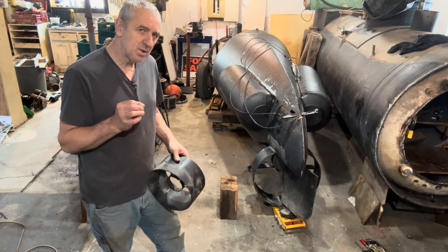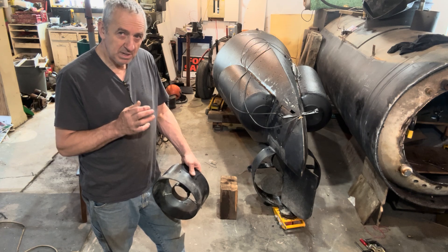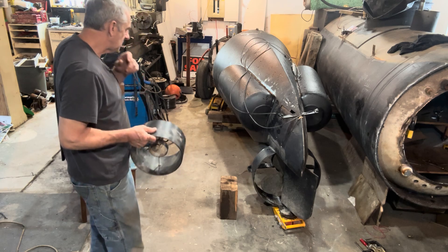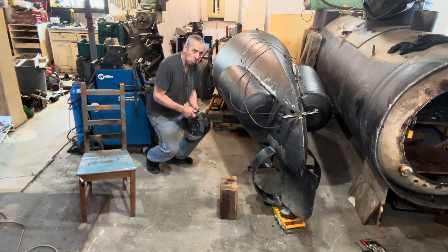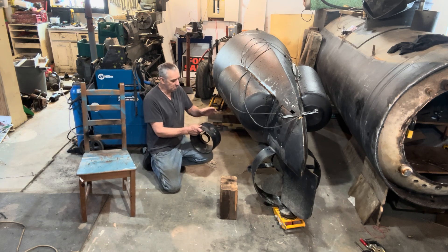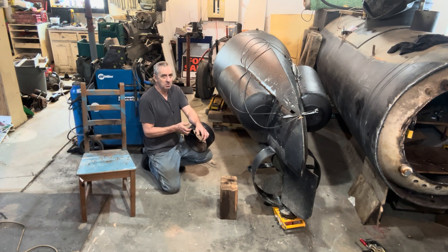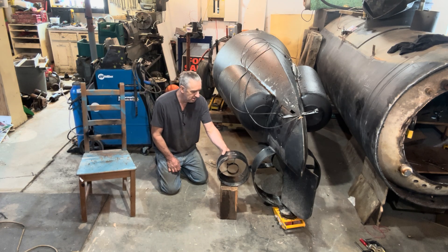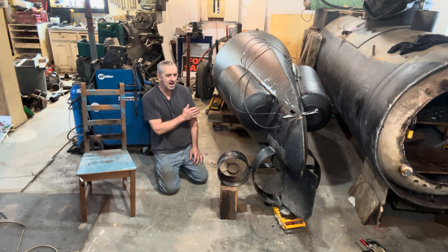Because I want the motors to run at 50 amps and they're actually 55 amps, so by shaving that prop down a little bit, I'm thinking it's going to draw just a wee bit less amperage. I don't want the motors to be wider than the main hull, but I don't want them hanging way out either. I could put them here, but they're a little bit vulnerable there, I think. And also they're really far from the batteries.